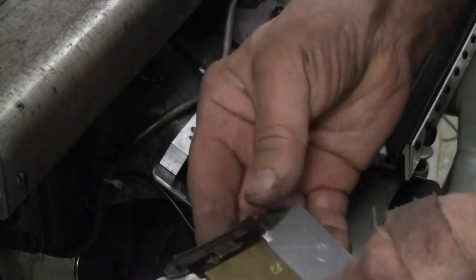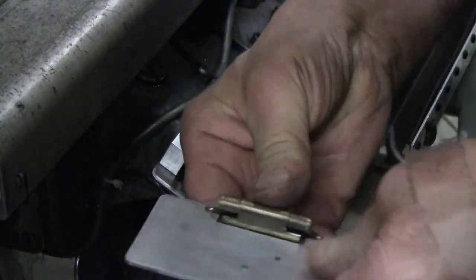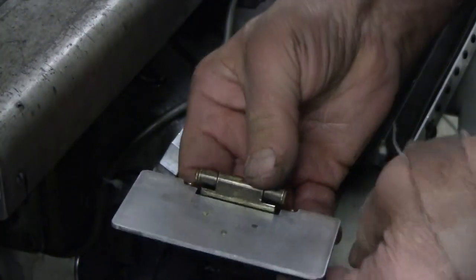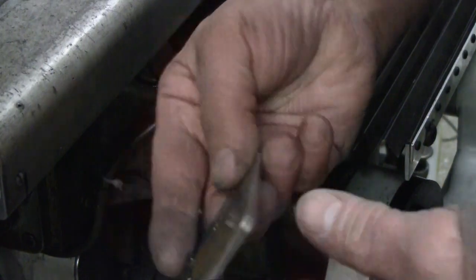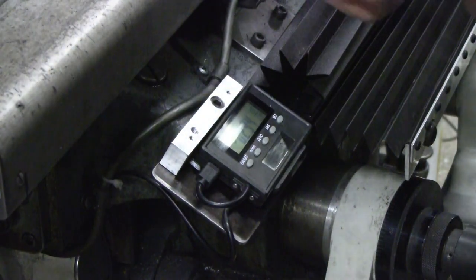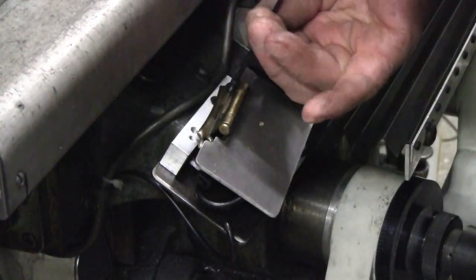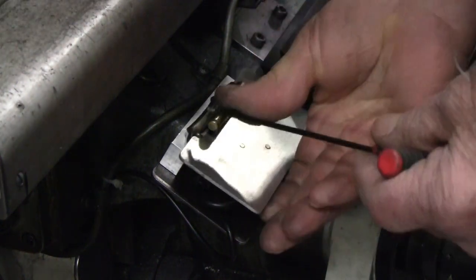here's a standard spring-loaded cabinet hinge, what they call sort of self-closing, not slow closing, but there's a snap action to keep it in place. So I cut out a piece of aluminum stock, drilled and tapped it for 6-32 brass flathead screws. We take a couple of 6-32 Allen fasteners into tapped holes in the aluminum stock there.